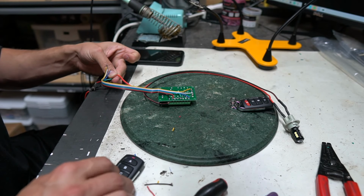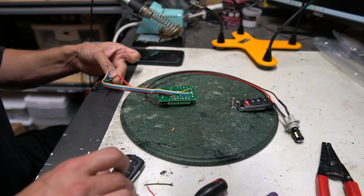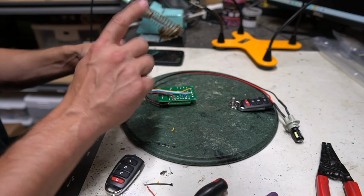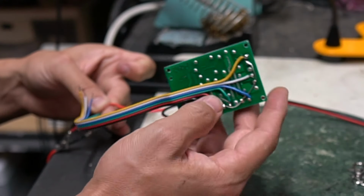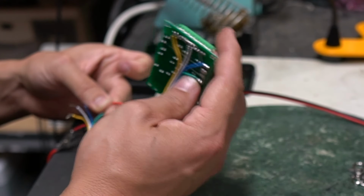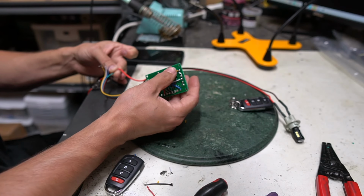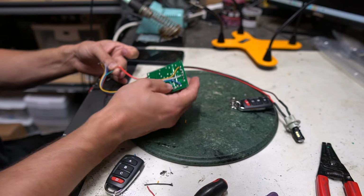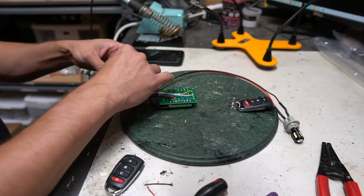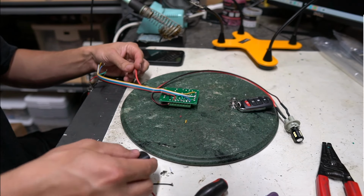So looks like green is hooked up to D, and for some reason it was getting power when it wasn't supposed to. Now it looks like that's all good to go. So obviously if you do wire everything up like this, make sure when you go over it all at the end that none of that shielding has been pushed through by any of the little parts. I think it was the little solder joint right there. In any case, I can now go through all of my different connections and test.